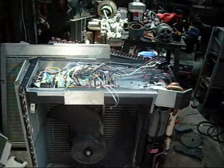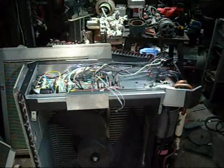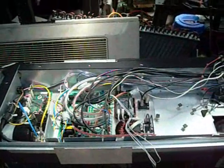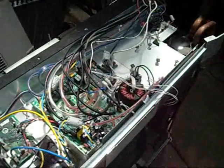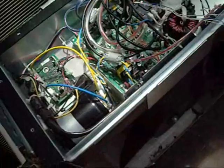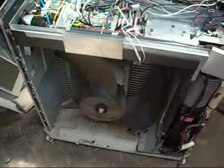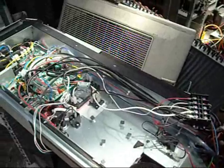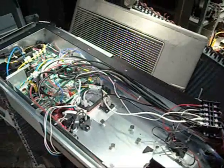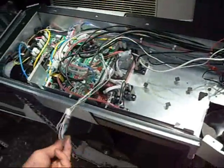EEV is doing its thing again. These always have a delay on startup so I might have to toggle a relay or something to get it to wake up. I think that's the fan cap there. I should at least power the fan up before I destroy it. It needs a signal from that board over there that I pulled out — that's probably why it's not starting now. That's the only signal that goes to it.